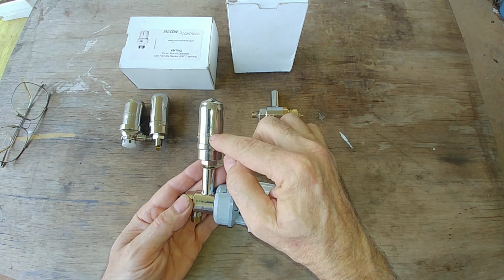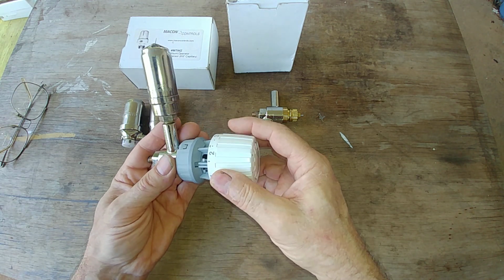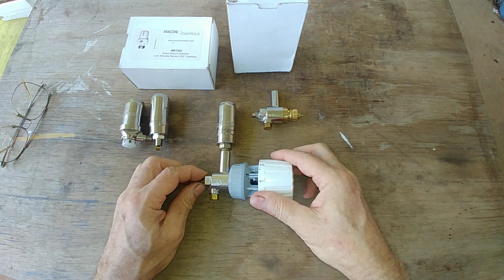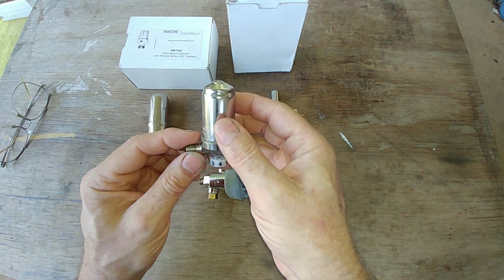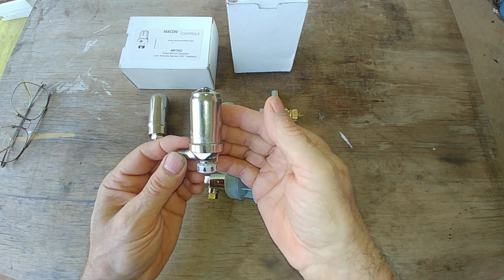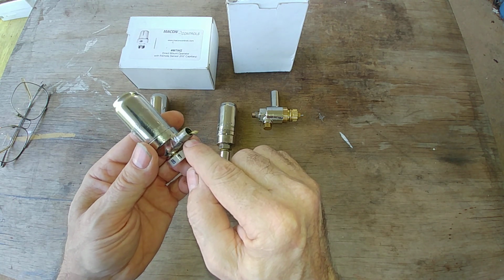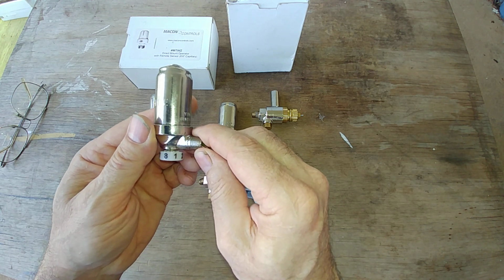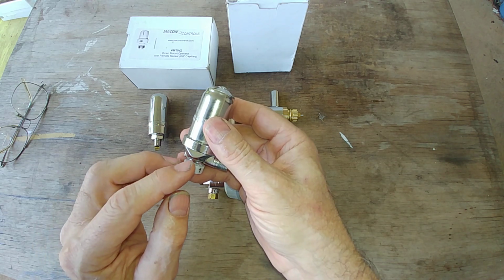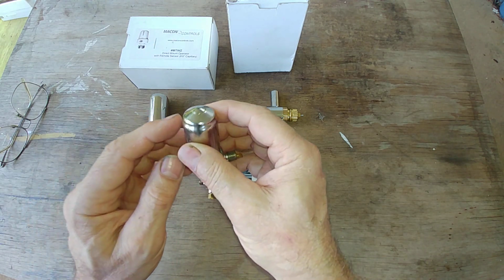You've got a radiator vent, you've got an actuator and temperature setting limiting control, and you've got a vacuum breaker. Now, normally what you have on a single pipe freestanding cast iron radiator is an angle vent. This threads into the 1/8 inch hole at the side opposite of the shutoff valve, and it allows the escape of air, and when the steam hits this eventually, the vent will shut against the steam.